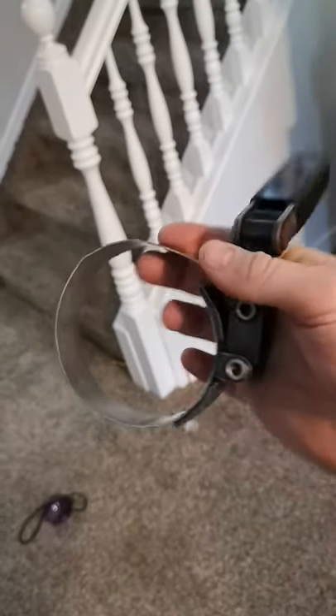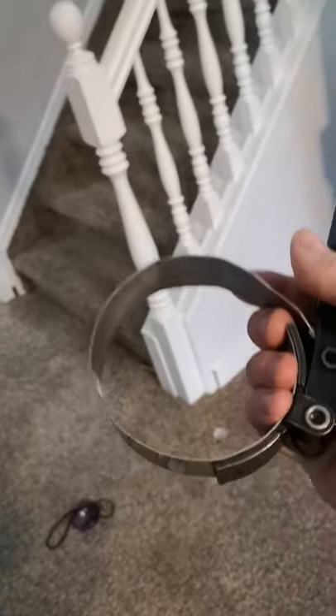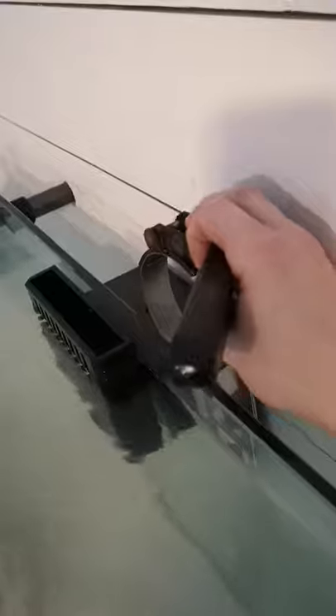It's a really big nut — I didn't have an adjustable crescent wrench or anything big enough, and there's no clearance for a wrench, pipe wrench, or channel locks. So what I did was I used an oil filter wrench — make sure you clean it first to get any oil off it. Obviously you don't want to dip this right into the water, so drain your tank down. It's awkward regardless, but stick it in there, put it on the nut with one hand, and it was perfect. Just reference the markings on the nut and give it a crank — a half turn. You don't want to over-tighten since all these pieces are plastic and acrylic.